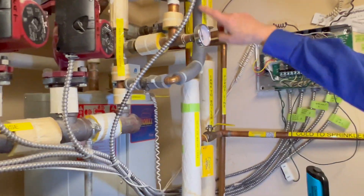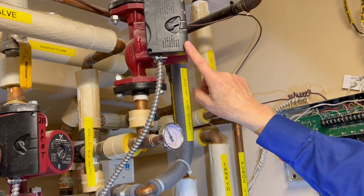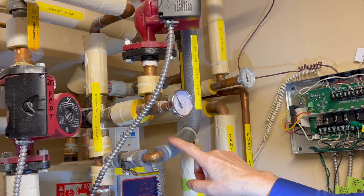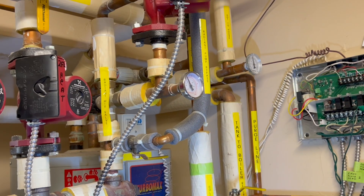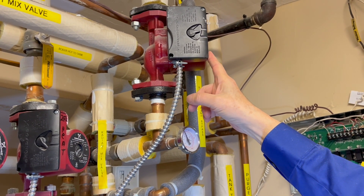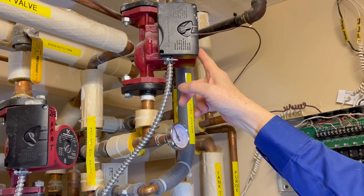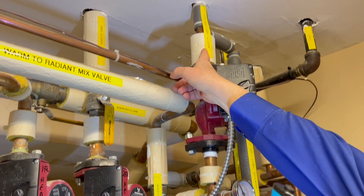There's a little bypass pipe here that can bypass the radiant pump just to initially fill the pipes in the floor. They'll open this valve and water will fill the floor in the upstairs bathroom. Then you close it and you're back on the pump, which pumps water very slowly through the plastic hosing inside the master bathroom floor. Right up here is the output to the radiant floor.